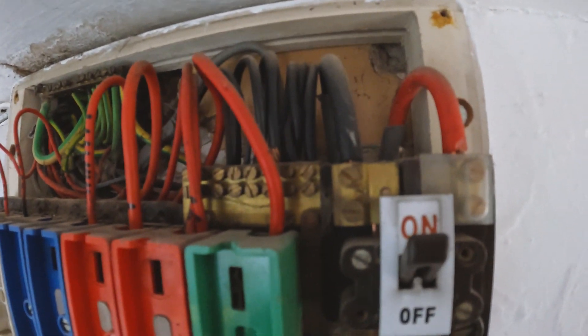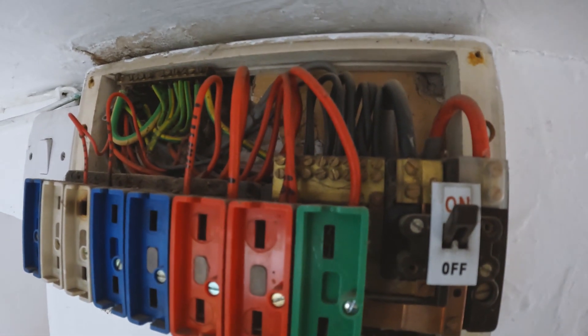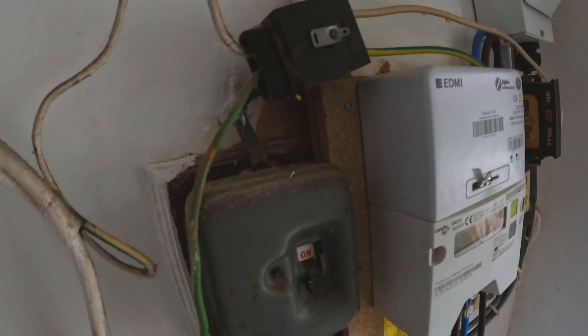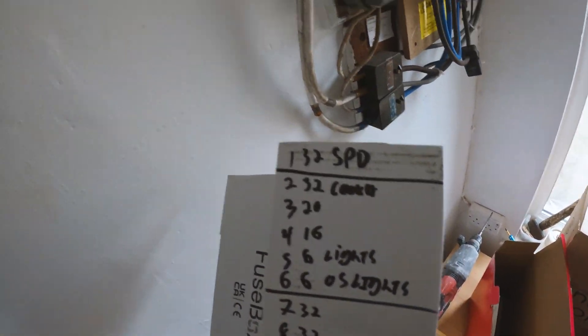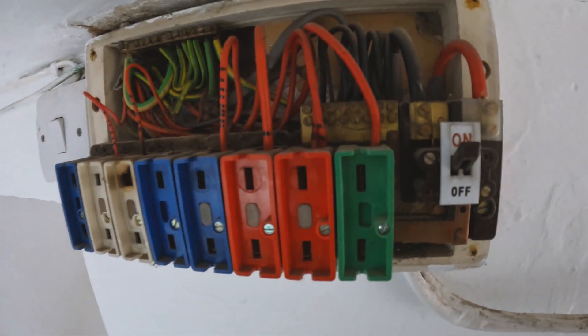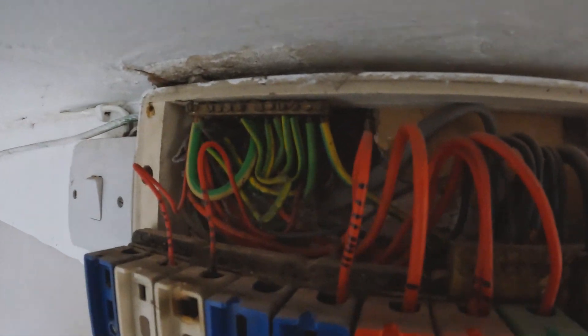That was probably an old shower cable on this green 45-amp, so what we'll do is just cap it off in the back of the fuse board — just to let someone reuse that cable — but we won't connect it back up as it never had a fuse in. There's also another cable here, a 2.5mm for something; we'll just extend that and clip it along into the new fuse board. If it was powered up before, we're going to power it up again. These tallies represent where each circuit goes on the new board. Because it's twin-and-earth, we tally up one for the whole cable; we'll have to lay in the earth and neutral. If we were in singles, we'd have to tally up earths and neutrals separately — a bit harder.